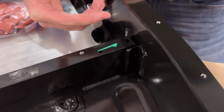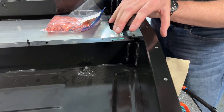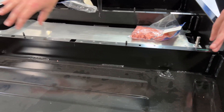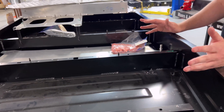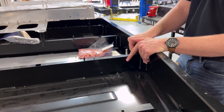You have to kind of leverage the overall roll-up of machining out the wall of this particular extrusion, and then if you wanted to have these extrusions with the ability to float in between, consider how that affects the overall buildup and stack of the pack. This is probably a relatively simple and elegant strategy, even though it has some additional components compared to the Mach-E.